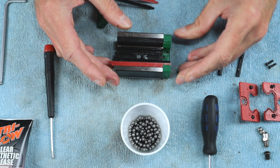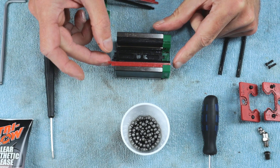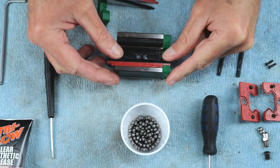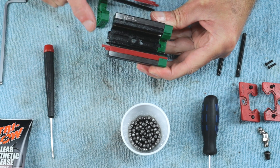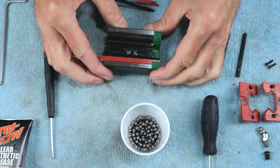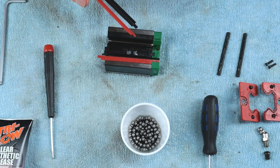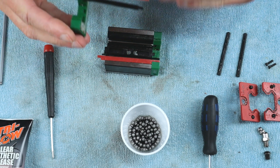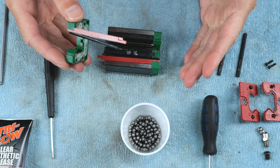Both channels are filled as well as I can. I put one of the green sides back on. This side has the black guide attached to it, and I also put in the red sealing lip. The red sealing pieces need to face so that the injection pin dimples — the red round dimples in the plastic piece — are facing down.